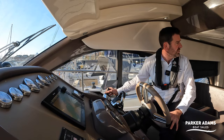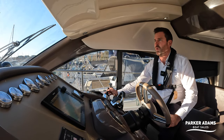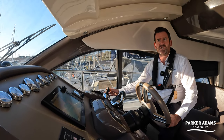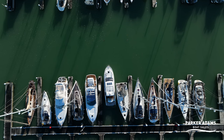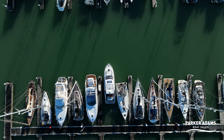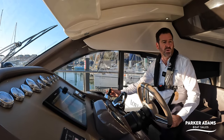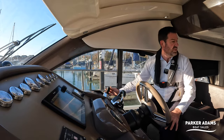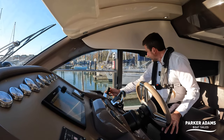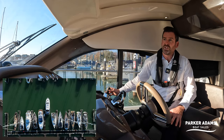Nick is just taking off the last couple of lines now and he'll let me know when all lines are off. We're going to manoeuvre off the dock by simply using the joystick. I'm doing a very light right-hand twist just to take us off and keep us in a straight line, and if we need to come back across I can just turn slightly to the left. We're getting quite close to the yacht next to us — it's quite a tight berth — but just doing very small manoeuvres with my thumb. We're actually leaving the berth in a lovely controlled straight line.